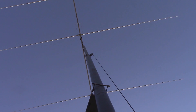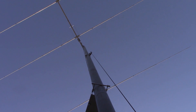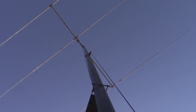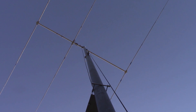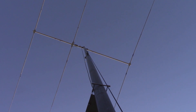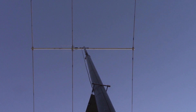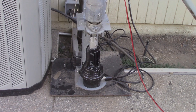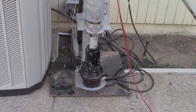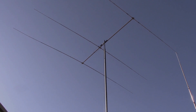So the whole tower turns with the antenna attached. The tube that extends from the rotating tower to the rotator turned up missing, so I had to fabricate something to make up that gap. I took some tubing and some concentric pieces and turned them together and put some through bolts to hold it together. I finally got all that working.